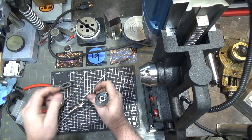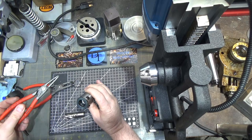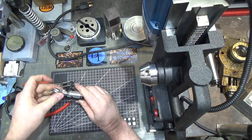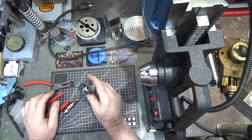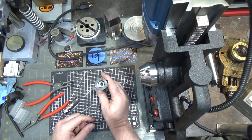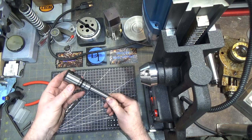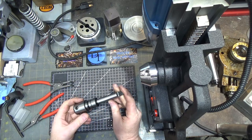The circlip is pretty big — that's the first position but not its final seating point. There it is, down there. Now it doesn't make contact at all. I'm not sure what that's for — maybe that's to control how quickly the fluid leaks around the outside of the allen screw. It's a really weird design: an allen-head bolt pushing up against what looks like a 10 or 12mm washer. Anyone have any ideas — please leave them in the comments because I'm not sure why they bothered with the expense of the spring if it wasn't needed for something.